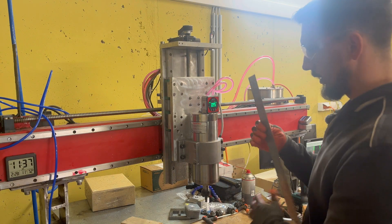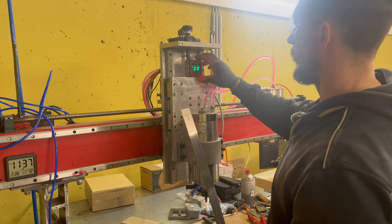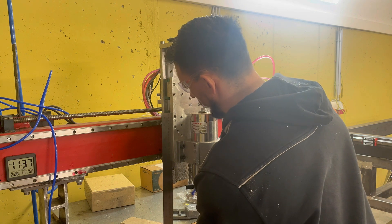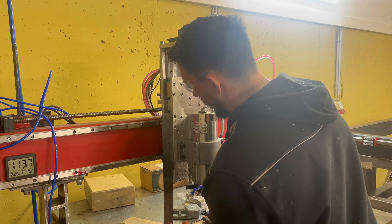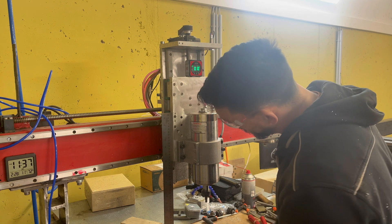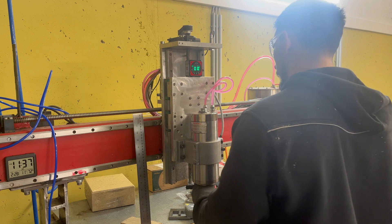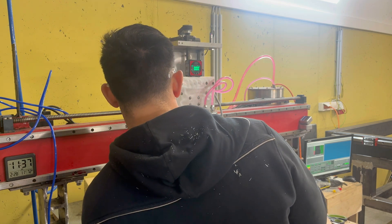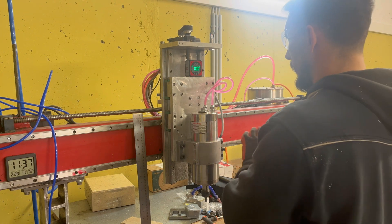Now what we're going to be working on is the z-plate. I'm going to show you this side right here. I'm just checking the squareness of this plate — since it was up here it said zero, but not anymore. The spoil board could also be not straight anymore. There's a slight little gap here — very slight. What we could do is tighten it around that plate there, then tighten this side down over here and torque it.